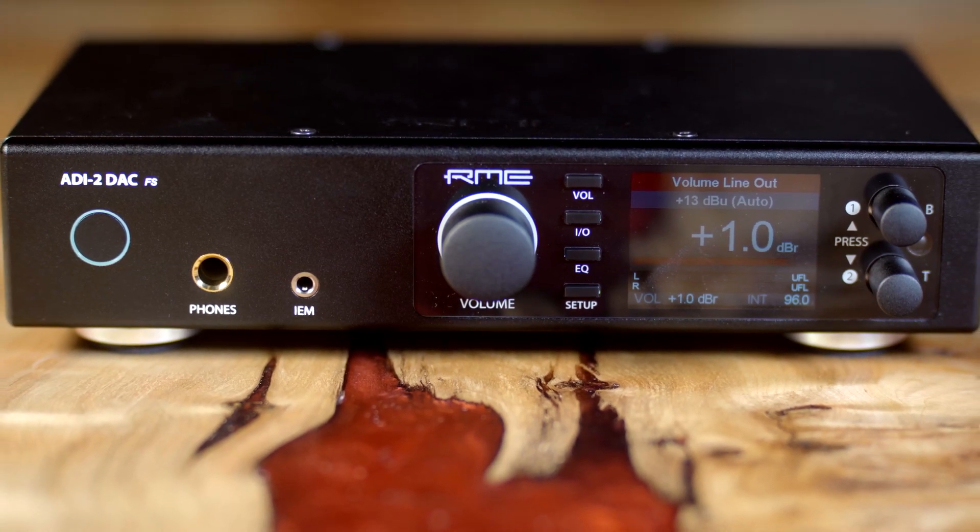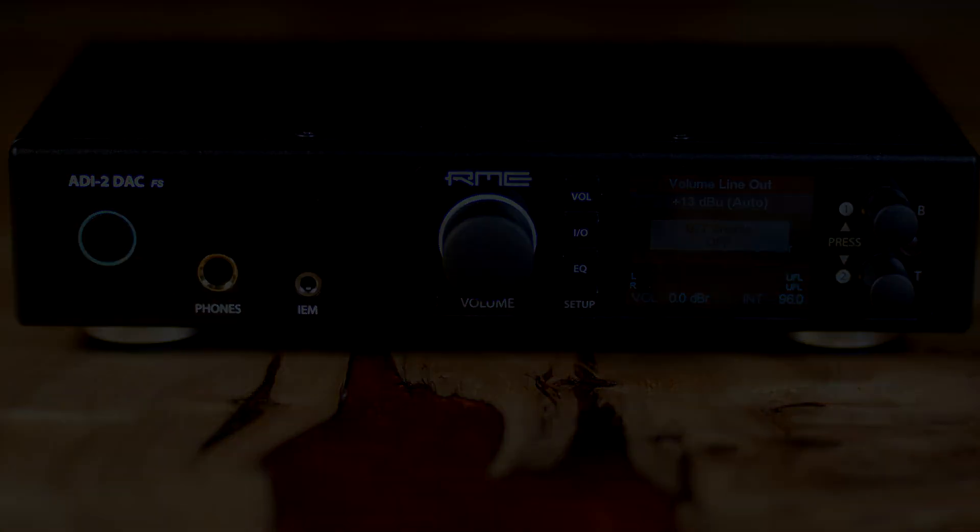There's also a really simple treble and bass control for broad adjustments. It has an adjustable output level, which I think is really important and useful on a DAC — it means you can pair directly with sensitive tube amplifiers or solid state amplifiers that might have particularly high or low input impedances. Overall, from a functionality standpoint, I actually can't think of too many units in the hi-fi realm that do as many things as the RME ADI-2 does.